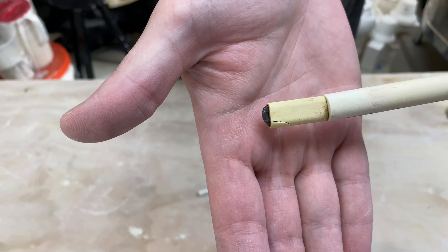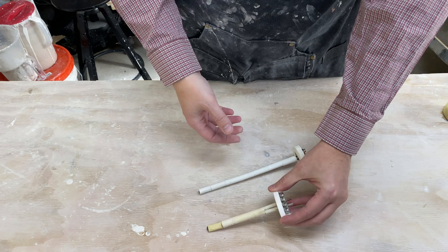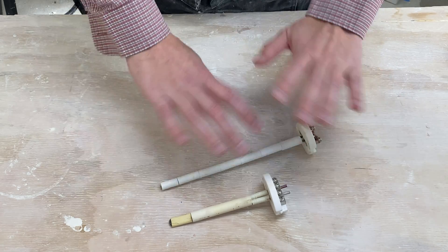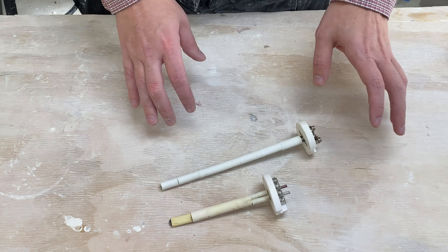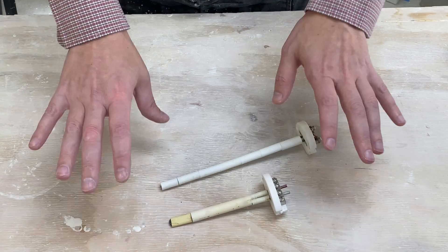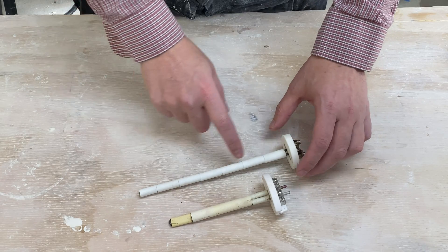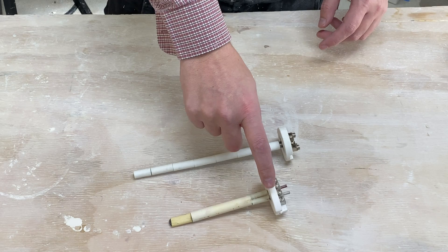There we go — there's the thermocouple. We'll undo the wires and I can show you this better. Here is the old thermocouple and the new one — you can see how corroded the old one is. They are different lengths, but I'm hoping I'll be able to just pull this back and it will be okay. These are the same type of thermocouple — they're both K-type thermocouples, which is often what's used in kilns. There are actually two different metals here that come together and as they heat up, the semiconductor physics creates the signal that gets measured and turned into a temperature.